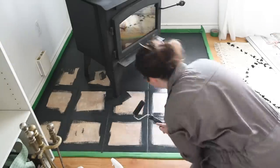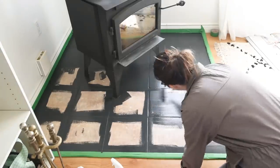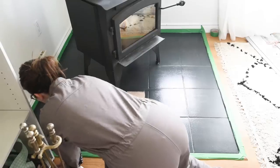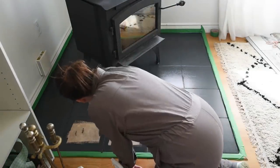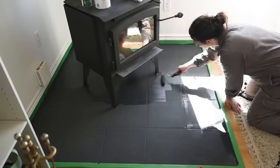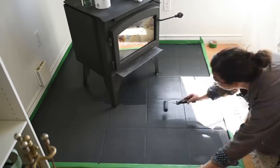For my tile, I was able to go from the inside corner outwards. When you're doing this, just figure out what's going to work for you so you're not stepping all over the tile as you do it. I always like using foam brushes on finishing work because it leaves a really nice streak-free finish with no brush lines. After I did one coat of chalk style paint, I went over and did a second coat. It's going to depend on the color of your tile and the color of your paint as to how many coats you'll need, so just use your own discretion.